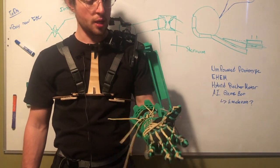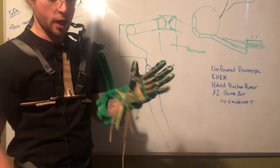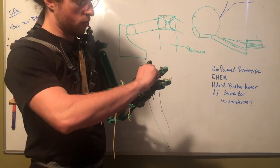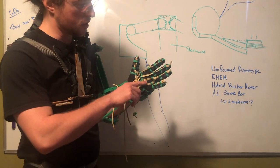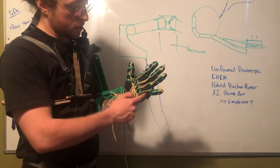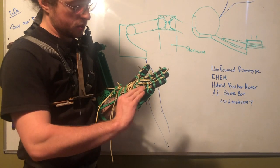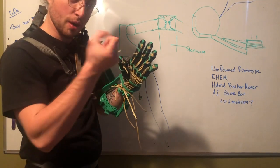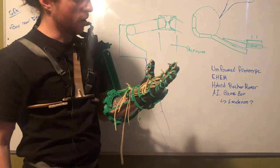I have quite the range of motion — I can reach all over without really hitting any hang-ups. And this isn't even actuated yet. Once there's an artificial neural net controlling the exoskeleton, the motion will be even smoother. Even with super low tolerance, un-lubricated parts, I'm still getting a really high level of movement. The hand is going to change entirely — each tendon will carry close to a thousand pounds of force, so having rings wrap all the way around your finger is dangerous.